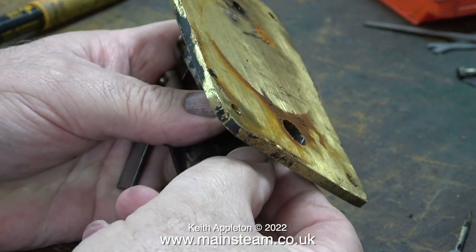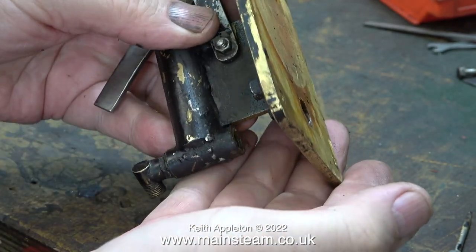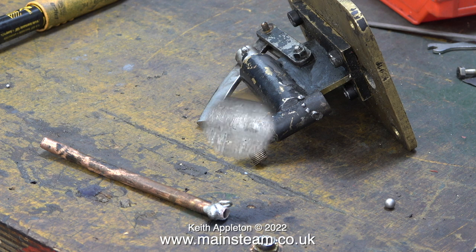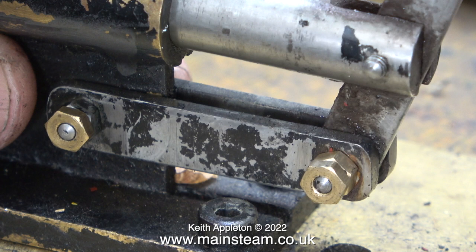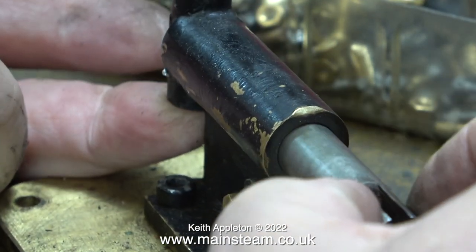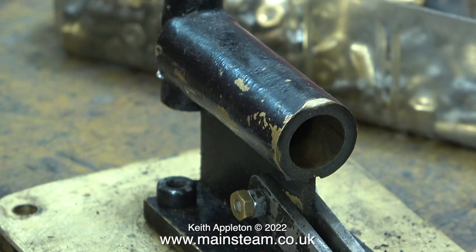First I'm going to replace this part. I remove the union and take the ball out — this is one of two stainless steel balls in the valve chest of the pump. There are even blobs of solder stuck to the main body. The pump shows quite a lot of play between the ram and the pump cylinder. Every one of the pump's linkages were ready to fall off, so I re-tightened the bolts and fitted lock nuts. Most of the wear is at the outer end of the cylinder. When I block the inlet with my finger I can feel some vacuum as I pull the ram back and forth, but the ram will be much better with a couple of o-rings fitted.